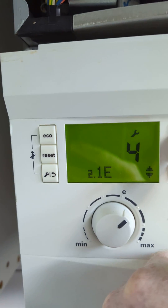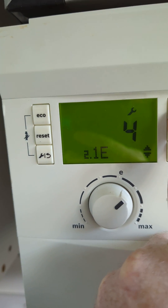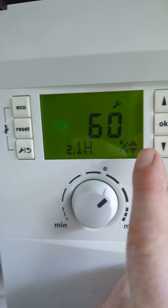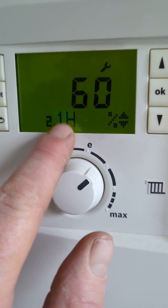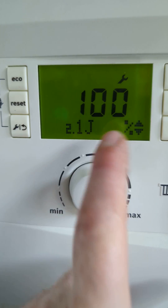This is a pump saving mode — it's either four or five for energy saving. Because we've put the pump in auto, we can alter H, which is the minimum pump speed, and J, which is the maximum pump speed. We can alter these should we wish.